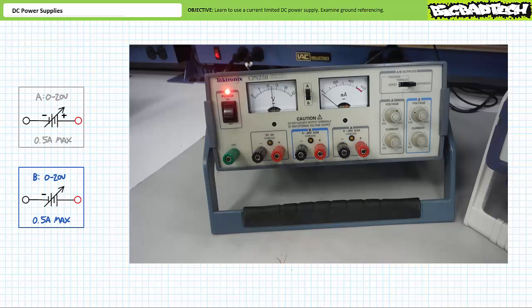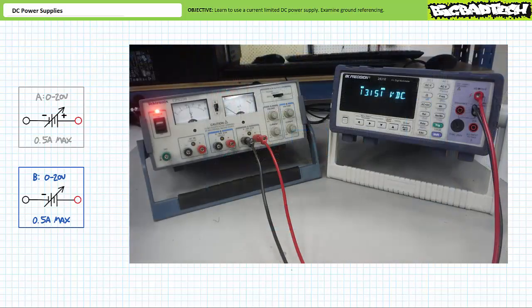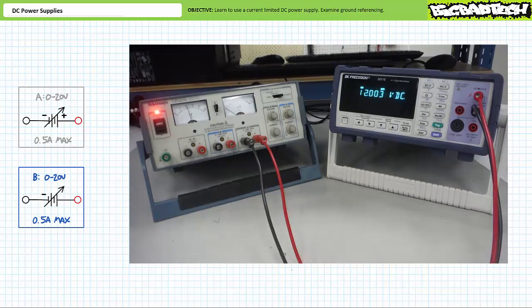How accurate is this needle voltmeter? Not bad, but it's not terribly precise either. At most, the analog scale is used to approximate the output. More accurate voltage measurements can be made with a DMM in DC voltmeter mode. A DC voltmeter demonstrates that source A is actually closer to 13-ish volts. A minor turn on the gray voltage control knob can dial the source A down to 12 volts.